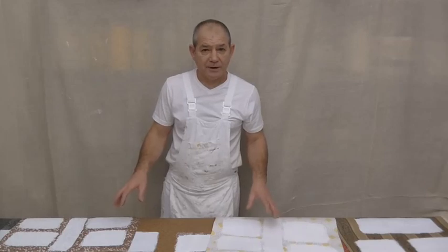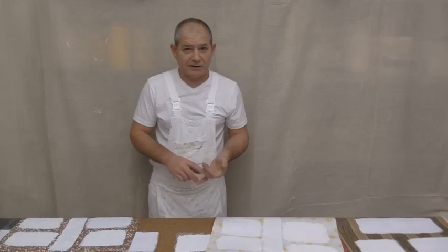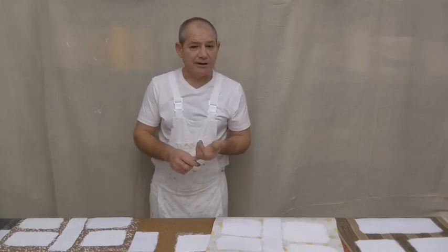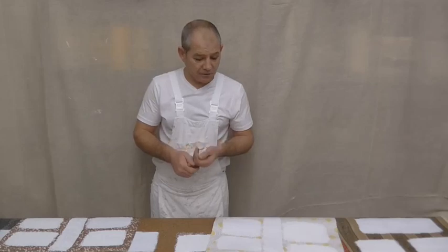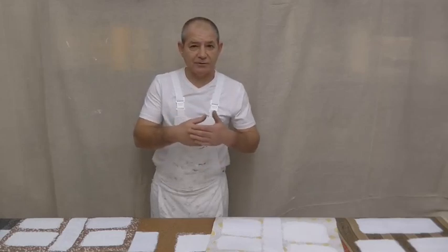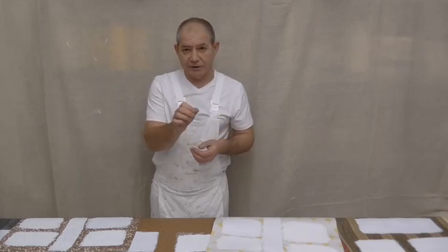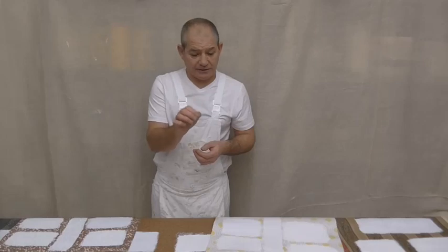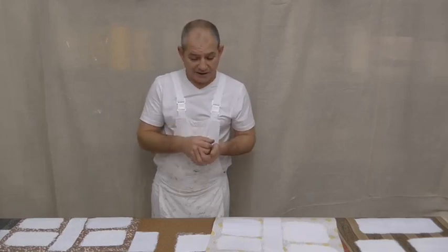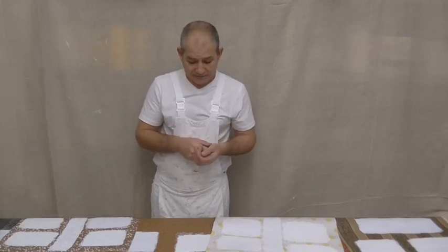Overall, most papers are paintable. You may get the odd exception. You may need to use something like Zinsser cover stain, which will help give a good prime surface. Something to paint onto, can bridge some of the gaps in the joints, stopping stains really, which overall you shouldn't get.